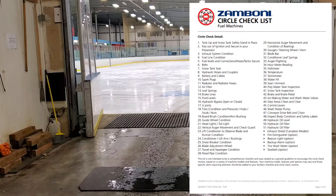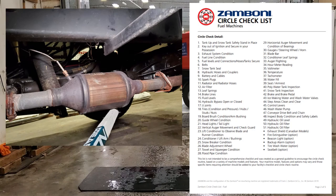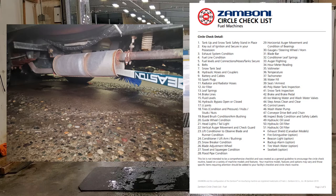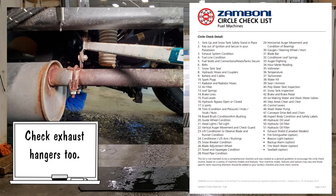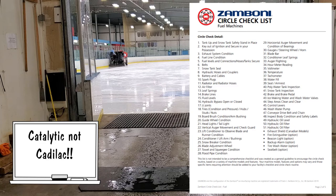Number two: key ignition and security — definitely important if you're working on the augers or any mechanical parts. You don't want someone to accidentally start the machine and get your hands caught. Number three: exhaust system condition. Inspect the exhaust system from the manifold all the way out to the exhaust pipe, keying on the catalytic converter, exhaust, and muffler. Those can rust out easily. On our 500, we had to replace the catalytic converter a number of times early on.